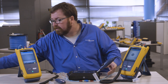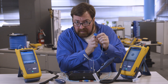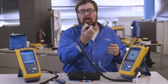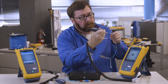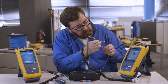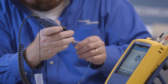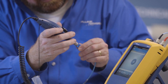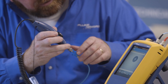Let me show you a trick for how to do this. I'm going to take my SC connector and keep the key on the right-hand side. Now I'm going to keep the focus knob on the top and put this back in motion. Let's adjust the focus — what I want to show you is that as I move up, the image moves up; move down, the image moves down. Kind of like a joystick — left and right. That'll make it easier to drive the image right into the center of the screen.